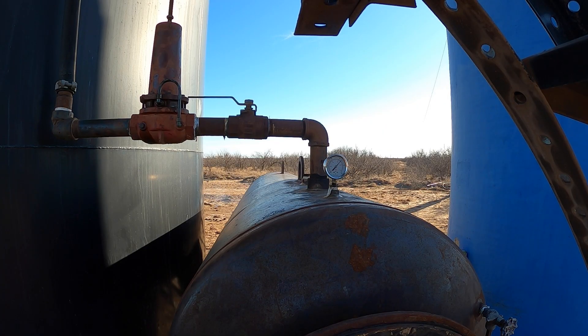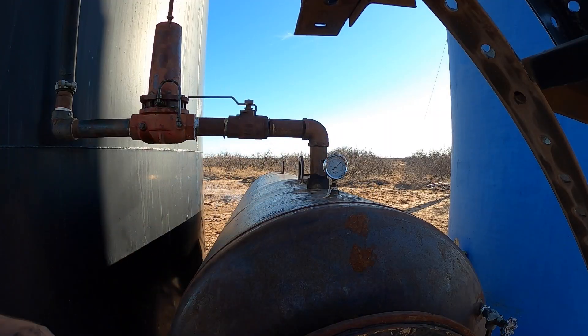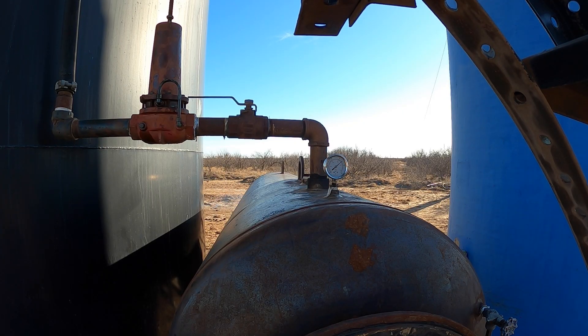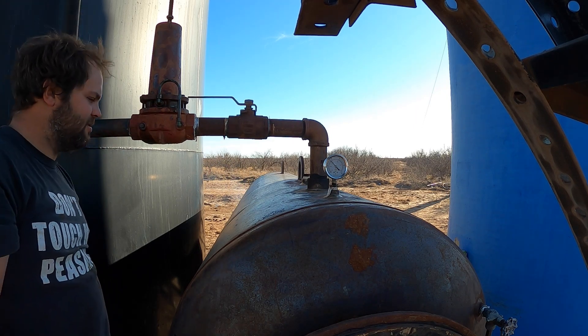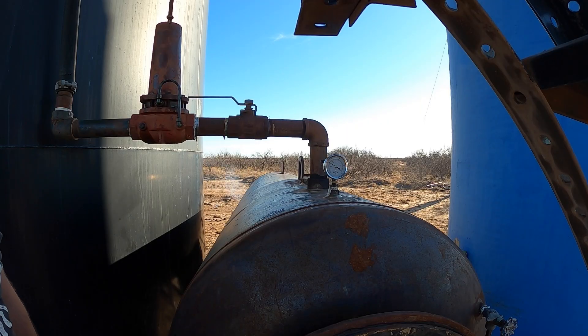It looks like that's going to be right on about 10 — probably closer to 9 once it straightens out. That is absolutely working. The next thing is I'm going to open the water dump valve. This should pretty much relieve all the pressure since the separator is completely full of water — it'll all go to the water tank. We'll listen to make sure this valve shuts completely off. I believe it has. I hear a gas bubble or two going through it, but I don't think there's any fluid going through it. Mission accomplished.